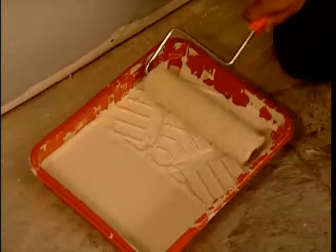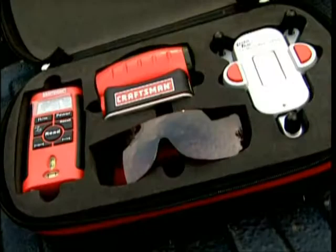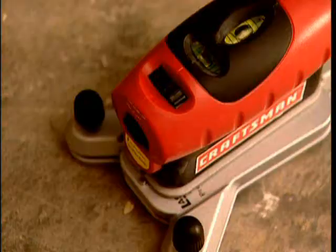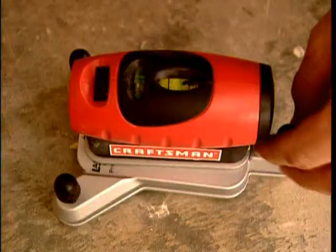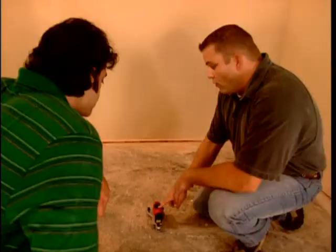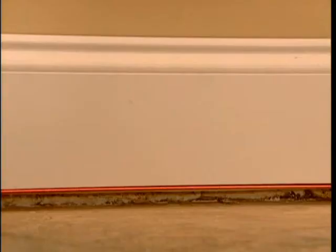After buying the correct amount of paint, Jason and Marcus got right to work, then moved on to the baseboards. This is the laser track level — today we're going to be using the precision leveling base. We're setting the baseboard at about half an inch off the ground so we can get the carpet underneath. With these three adjustments, I can position my line exactly where I need it. These levels make sure I get it level — once my bubble is on center, this line is going to be level. One of the best features of the laser level is that even if your floor is uneven, you're ensured that your baseboards will be straight and square.